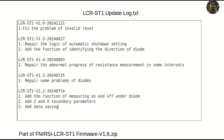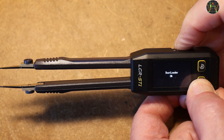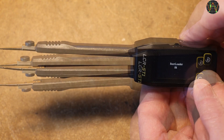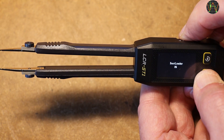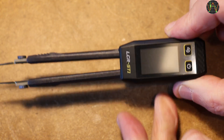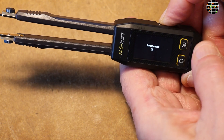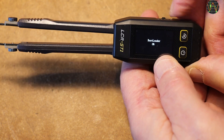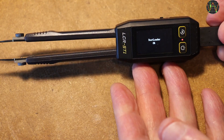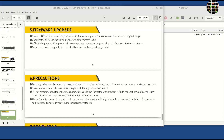To get into firmware upgrade mode, you have to press and hold the jog switch on the top while powering up. A bootloader OK message appears but disappears immediately when releasing the switches. After retrying and pressing some additional buttons, the bootloader stays on and I can connect the USB cable to the PC. It seems to expect a second press of either the power, menu, or jog wheel to confirm you really want the bootloader — I can't say which one did the trick since I tried all three. The manual's instructions on firmware upgrade are not a lot, and the first step is definitely more complicated than what's written.